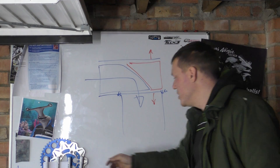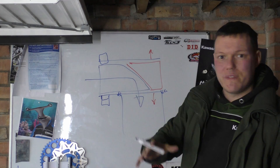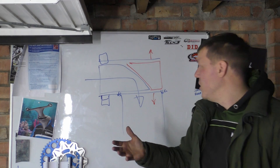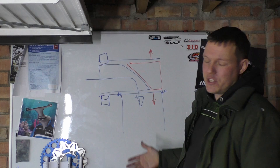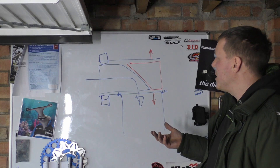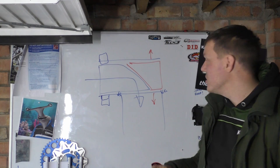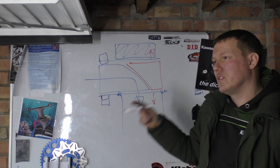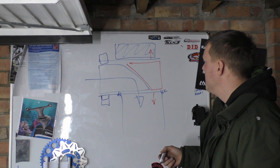You'd probably want to put your drive gear on the cold side so it doesn't shift as much. But doing this with one tube is going to be a pain. People might ask: can't you split the tube? No, because it's still going to conduct heat, and then splitting it means you need more seals — absolutely horrible. Could you water-cool it somehow? It's a rotating sleeve with very thin cross-section walls, so probably not. Maybe you could have water cooling where the sleeve sits, but the contact patch is spinning so quickly it would make very little difference.